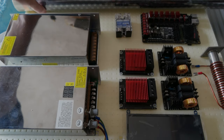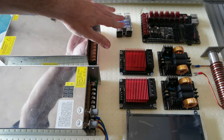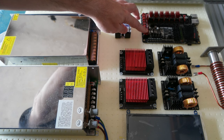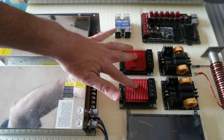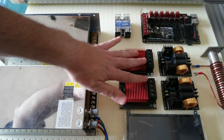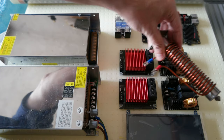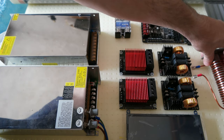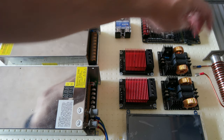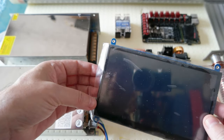so I'm going to drive this infrared bed film using a DC-AC relay, which is driven by the board on the bed side. These two are DC-to-DC MOSFETs, so they will get power from here, and then they will drive these two induction elements to let current inside this coil and heat the extruder. Okay, then I will have all the motor wiring, the CB1 here, and then an HDMI connection to this display, which I already tested, and I showed a video about it.